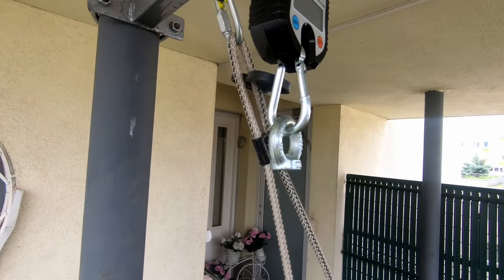But a small disclaimer, before you run out and change the bolts on your car tires, don't forget that this is plastic. Especially PLA, it cannot handle high temperatures, and of course the wear of the plastic is much faster. And also with this equipment I could measure only the ultimate strength, but it would be much better if I could measure the yield point, because that's the elasticity level. At the yield point, if I remove the load, theoretically the test probe should return to its original size.